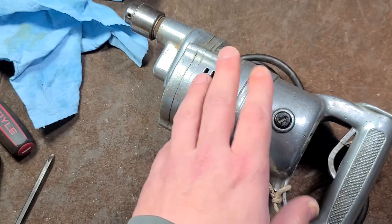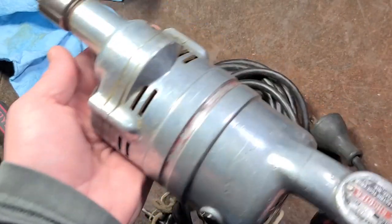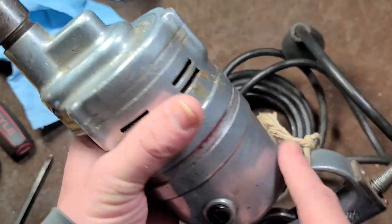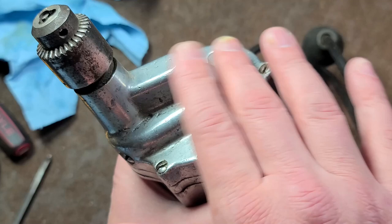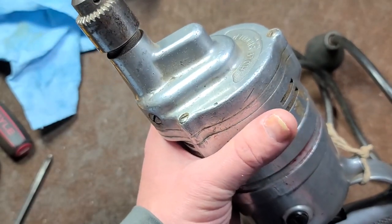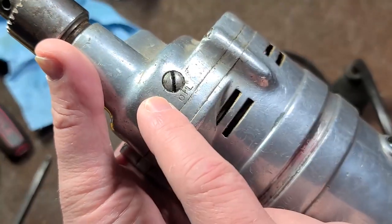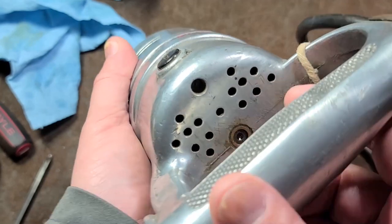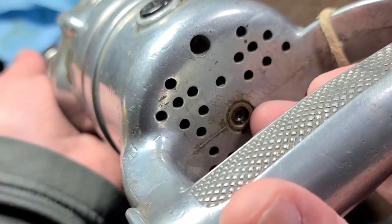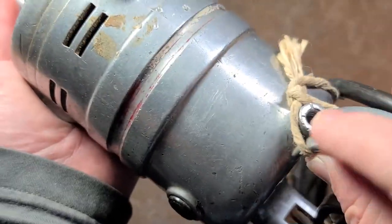So I'm not going to do a big review or how to fix a power cord, because this is one of the older sleeve bearing ones. The slightly newer units actually had a vent panel on the bottom and a more rounded gear case instead of the stepped one, and those were the ones that had ball bearings. I'm going to wait until I can dig up one of those. They do have an oil port here and right here — that is actually the back, the rear bronze bearing for the back of the motor — and they also had an oil-filled port right there.